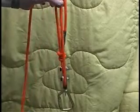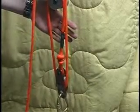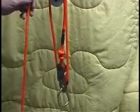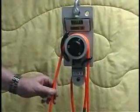Here's the free side rope, and here are the load side ropes. Notice there are three of them — that's where you get the three-to-one ratio. This is called a three-to-one ratio system.